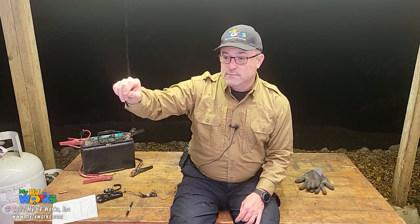You're going to take one screw off the top, and then those little tangs you're going to pull off, and the cover comes off. On the left-hand side, you're going to see a glass fuse. And what I want you to do is take your meter just to the right of that control board. There's going to be a stud that sticks out of the back that's welded to the back body of that refrigerator. So you take your meter, take your black lead, and connect it to the same ground that the refrigerator is considering ground. You're not going to pick some ground someplace else, because your problem may be a ground issue. It could be loose wires on your ground. But on the AC, you're going to get it coming from the receptacle there, and it's going to go right into your board right there.